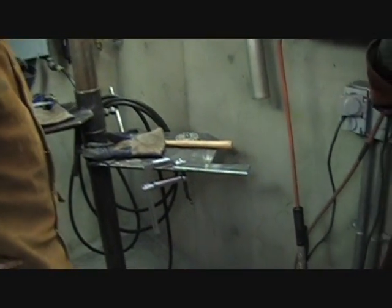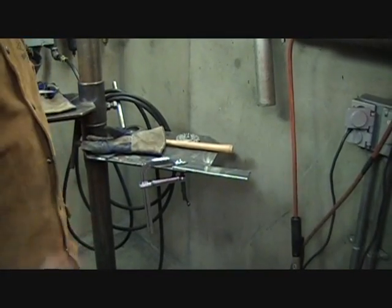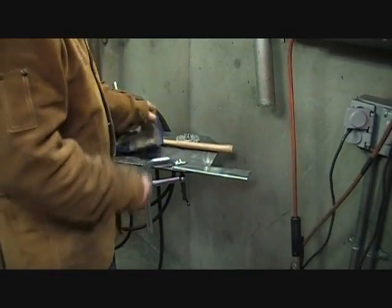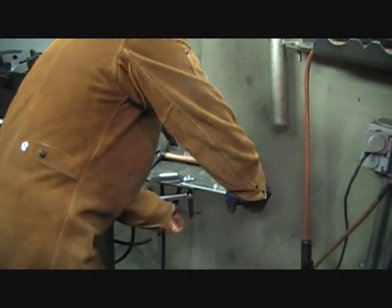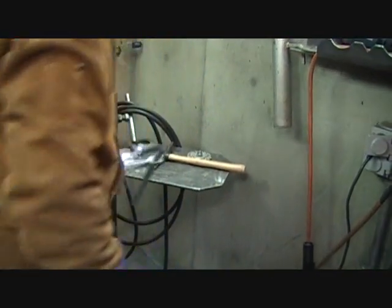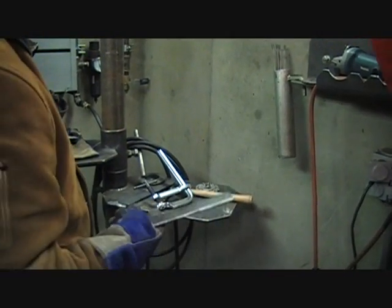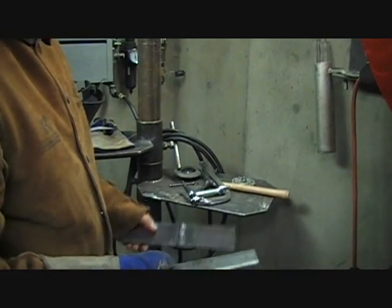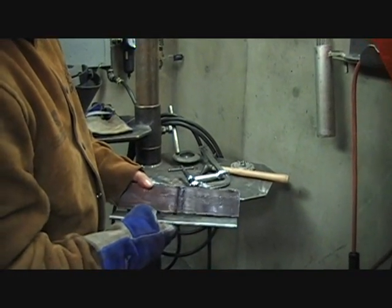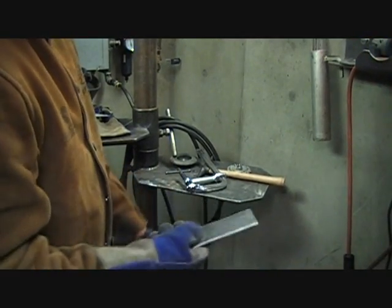Matt is returning after a break in the Marine Corps and he's working on preparing a sample for destructive tests. He did an angle iron splice that's in the third quarter of our curriculum. We do it with stick and also with gas metal arc welding. He did it with stick. It was in a fixed position so he had to weld flat, two verticals, and overhead to complete it.